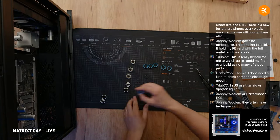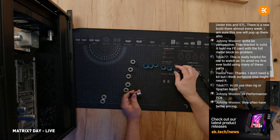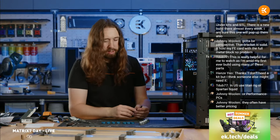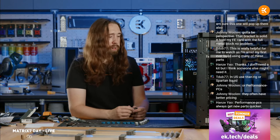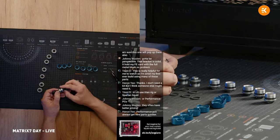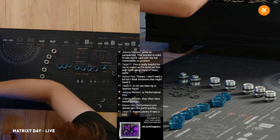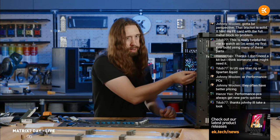Johnny knows if it can hold a Founders Edition, it can hold just about anything. Definitely true to the Founders Edition, especially with the active backplate, has to be the heaviest GPU block of all time. But the good thing it does have going for it is all of the weight is at the back, and it's the same for these new big, long, massive GPUs, but all of the copper is at the back half. There's no big weight out the front of the card, and it does make a difference when you're hanging it off a motherboard slot, whereas an air cooler, the weight's pretty evenly distributed and you have still full-on heatsink right down at the end.